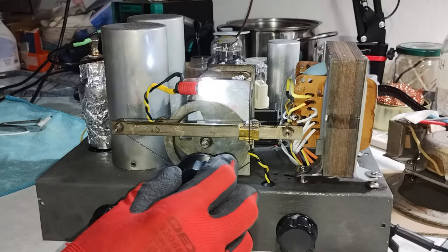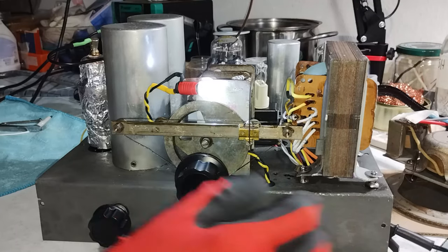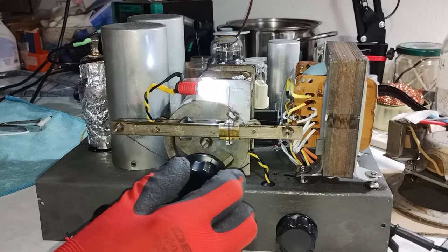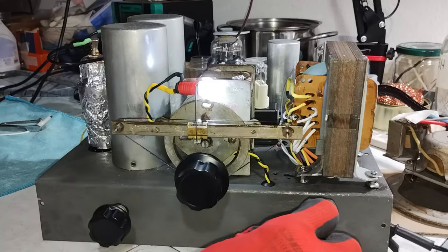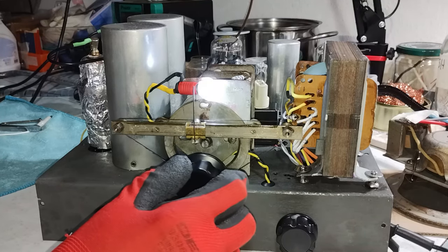Even though the tubes type 6D6 and 6C6 are shielded internally, shielding them externally improved slightly the reception by reducing the tendency to oscillate. Unfortunately, the shield bases were not available, so some kitchen aluminum foil did the job, connecting it to the chassis.